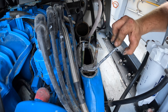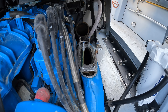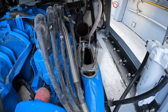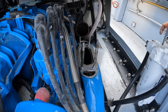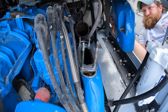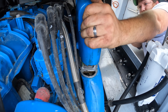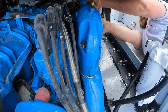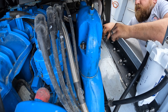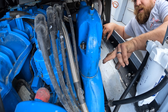What I'm doing right here is putting some high-temp anti-seize on it so that when you go to replace this again it'll come up nice and easy. I put some around the threads of the bolts as well so those nuts won't seize up and will be a little easier to get off next time. Alright, that gasket is on — I'm going to go ahead and lay in the elbow real slowly. Looks pretty good. I'm going to get it bolted down and then connect the hoses, but I want to get it bolted down first so the gasket isn't sliding around.